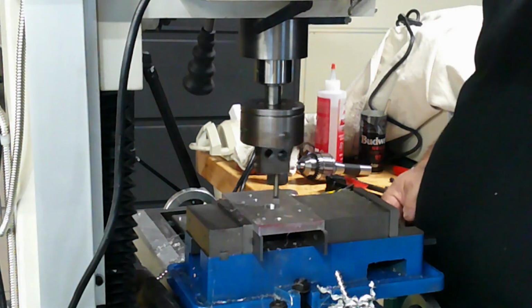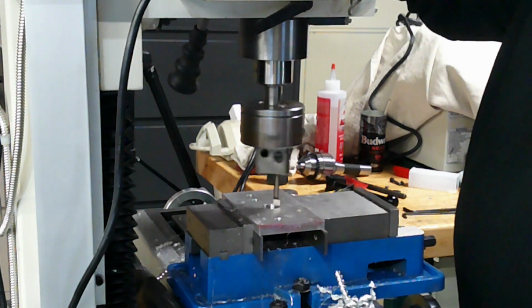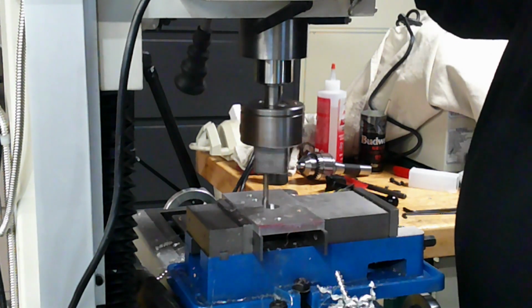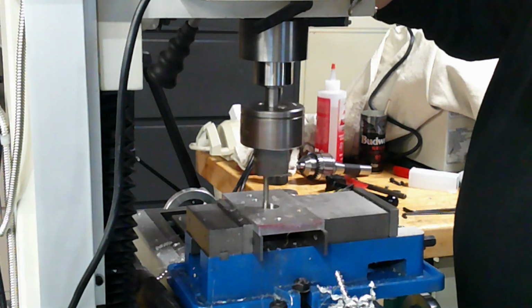With all metal cutting processes, stiffness is the key when boring, so do everything you can to maximize it. Use the largest diameter boring bar and the shortest clamping length possible.